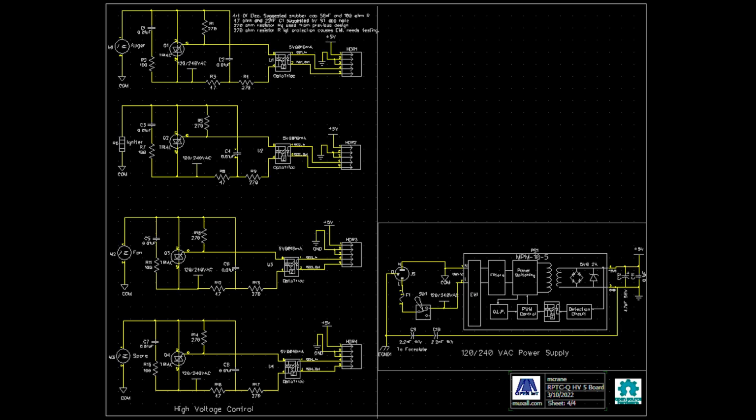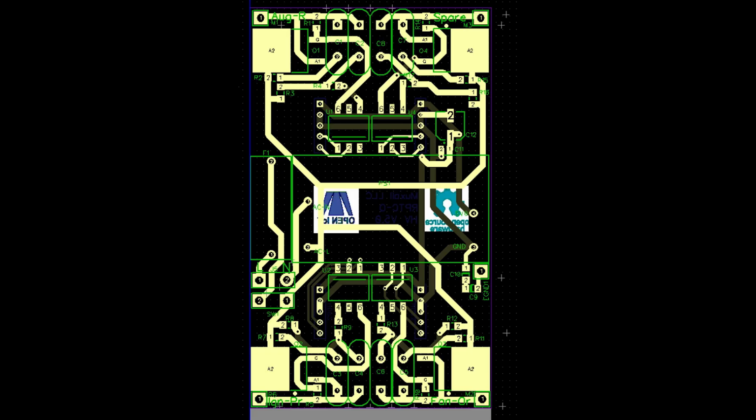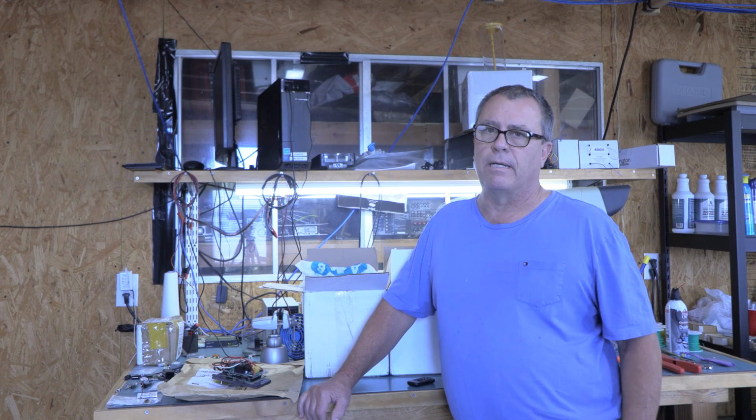When an electronic designer lays out a PCB and specs the electronics components, he or she decides what the load carrying capacity of the traces and components will be. When I designed the Muxall Pro BBQ Controller PCB, I designed it to handle 5 amps on the traces and components. As any good engineer will do, I over-designed it to carry more than 5 amps, maybe 7 to 10 amps, just to be safe. They should handle quite a bit of current.